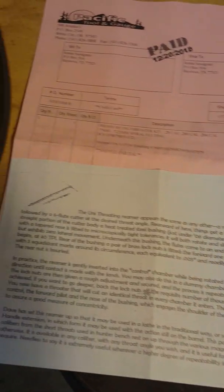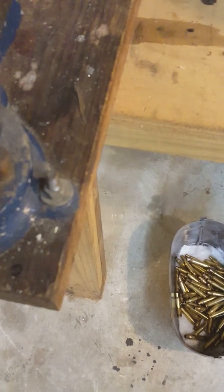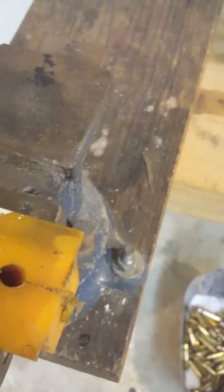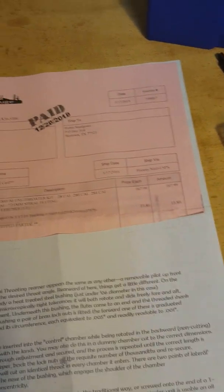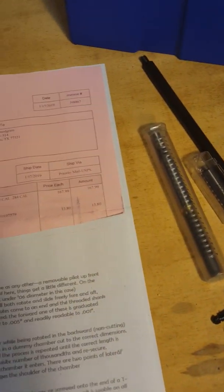Anyway, if one of you guys have used one of these unithroaters before — the way this is set up — I should be able to take the barreled action out of the stock and come over here to my vise. I'd probably put some cloth in between here too, just to make sure I don't mar the finish on my paint job. Set it where the barrel is up and down, the action is straight up and down, then you put the reamer setup in there, turn it backwards until it settles to the bottom, and run your brass down. All that stuff is pretty straightforward as far as the way you use this thing. But if y'all have used this without the three-quarter inch bushing that goes in the back of the receiver, let me know.